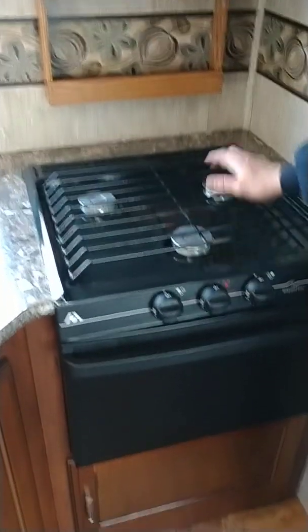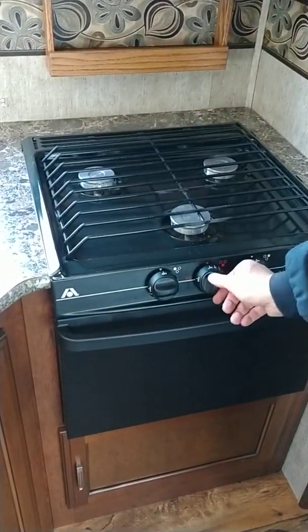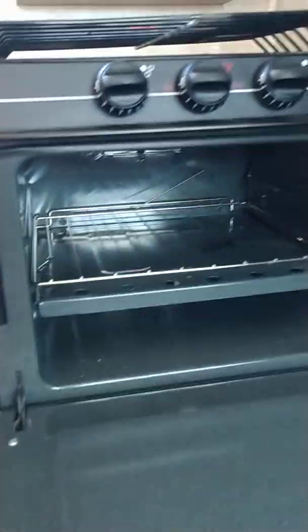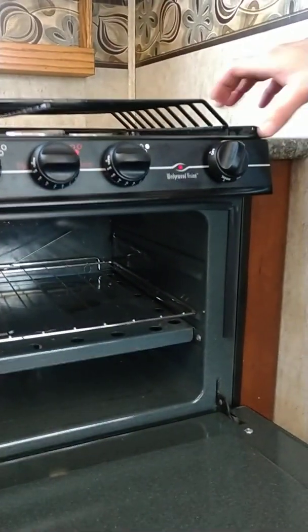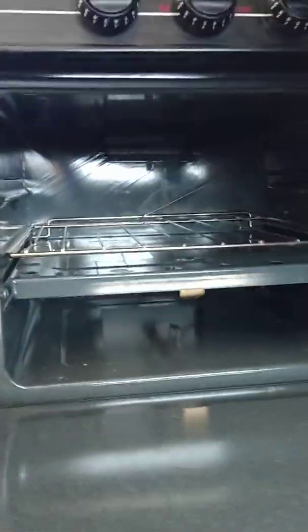Now, you are going to manually light these burners with a lighter. You're going to turn the knob, and you're going to light them. Same thing goes with the pilot light for the oven. So basically, I would turn this switch to pilot, says push and hold. I would push and hold it, and I would reach under back at the thermocoupler on the right side of the tube and try to light that. Flicking the lighter works much better than holding a flame.